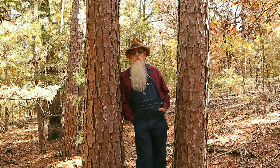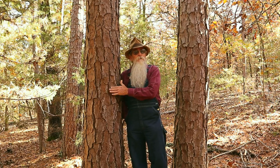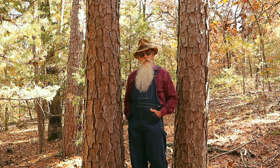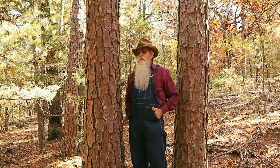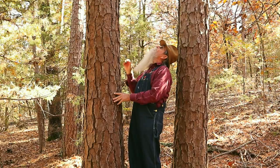We just wanted to walk through the woods today and show you some pine trees. This pine tree on my right is really a sweet tree for a log wall. I've worked with smaller stuff and stuff that was two and a half times the diameter of this tree, but I'd rather work with trees that are no less than 10 inches on the tip after it's cut — that's the small end of the log. The butt is naturally the trunk down close to the ground.